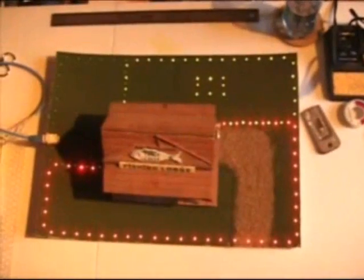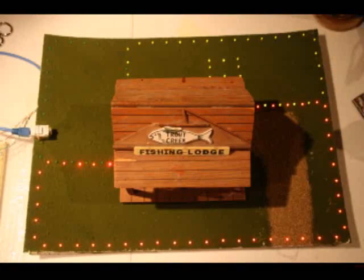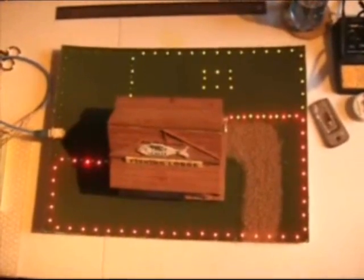Since it's impossible to see an invisible dog fence in action with one's eyes, I decided to build a model yard for the project that is similar to the zone diagram we just saw. The zones are indicated by different colored arrays of LED lights. Since each of the LED arrays is on a single electrical circuit, we can easily simulate the invisible fence zone, since both only require a closed loop in order to operate. In the model yard, the radio signal is replaced by a DC current, but since all we really care about is continuity in the circuit, the same hardware and software designs will work for both.